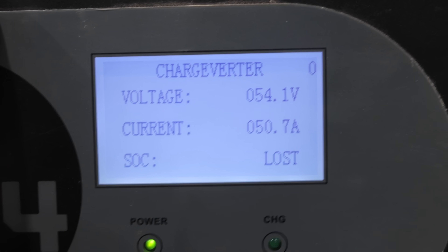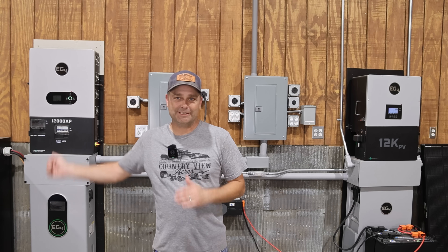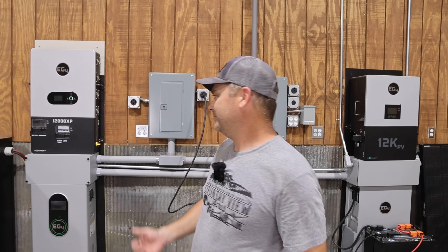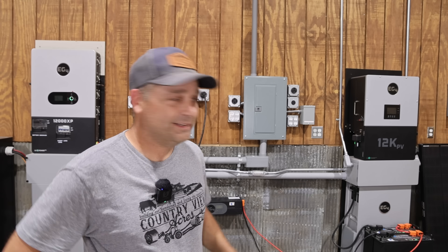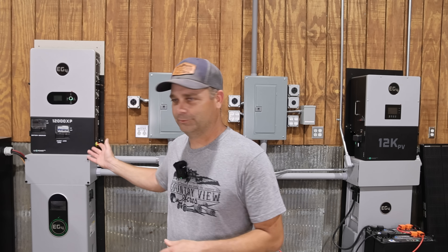You can hopefully see it is charging at 50 amps — that's what I have it set at. Right now this system is at 74% charged and we've only got maybe an hour and a half of sun left in the day, but whatever extra power we do have, at least it's going to put that in this battery bank and that's going to help me make it through the night. This is the way I've decided to use the smart load on the 12,000 XP. It's a little outside the box since you can really only do this if you've got multiple systems, but I do think it's going to benefit me. I'm going to be able to use this system when it has extra power to boost my other system. I'm definitely interested to hear from you guys — how would you use a smart load on an all-in-one inverter? I think that's going to be it for this video. I hope you have a great day and I'll see you next time.